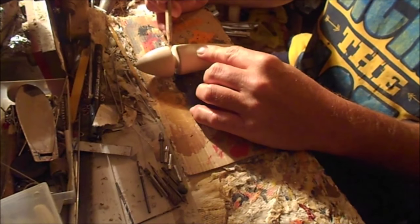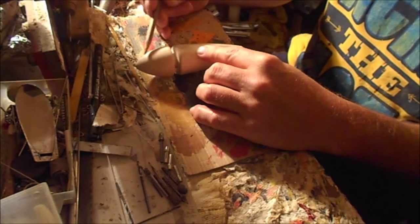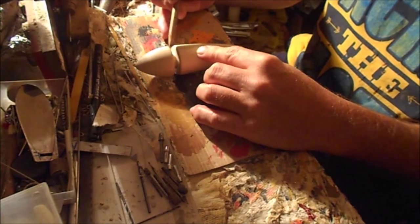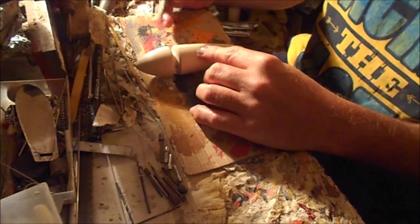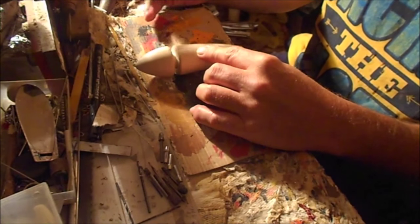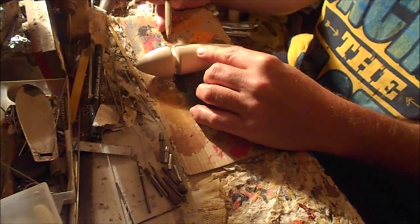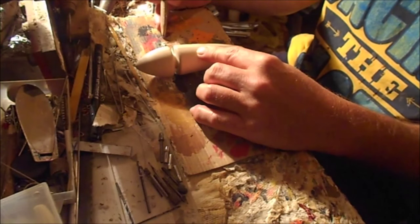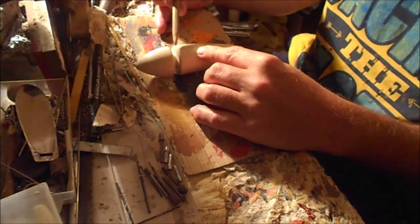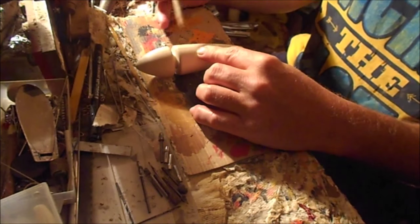What was missing whilst the lure was still on the lathe was the fine sanding and rounding off the edges. I always like to round off edges, because sharp edges tend to crack easily, and epoxy top coat doesn't adhere very well to sharp edges, so I always round them off.